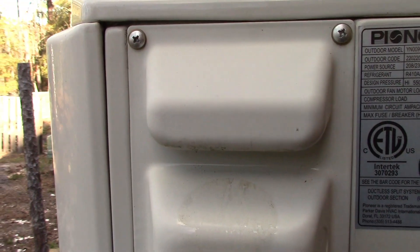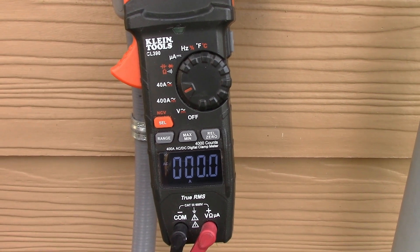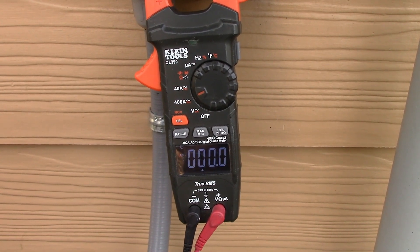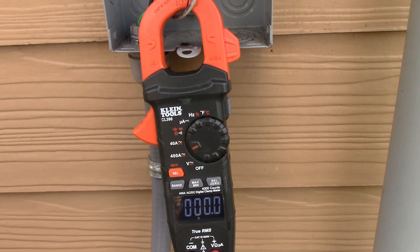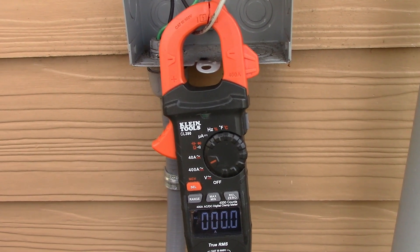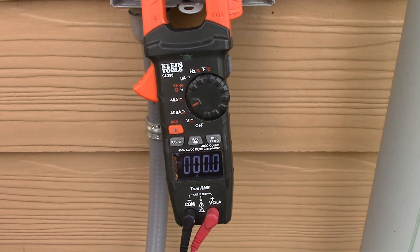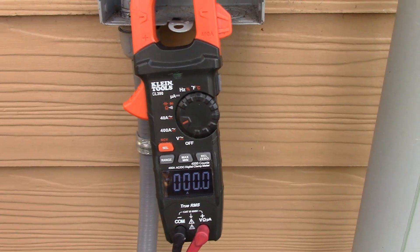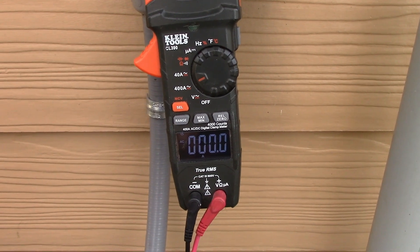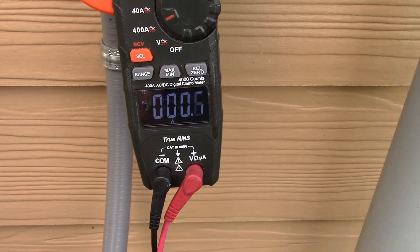Let me show you my air conditioner. This is the disconnect for my air conditioner — right now it is powered. Air conditioners have a built-in time delay. When the unit is running and there's a power interruption, the compressor turns off and then tries to start back up with high pressure still in it, causing what's called short cycling, which is very damaging. Units come with a built-in time delay that shuts the unit down for five minutes, allows the pressure to normalize, and then it starts under normal conditions.